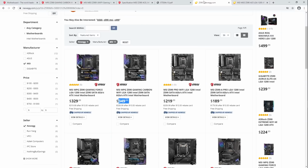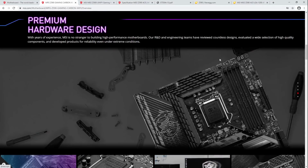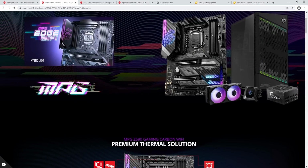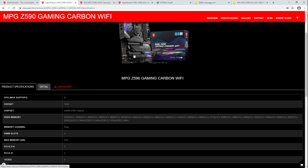I think there might be some boards that are more cost effective off the top of my head, but this might be one of the cheapest motherboards with a postcode. There are other motherboards where I've been like, oh my god, a cheap board with a postcode, and then I got it, and it's also got a 4-layer PCB, so while it'll tell you that your memory overclock doesn't work, it won't help you fix it, because the board just doesn't clock that high. But this is a 6-layer PCB. So it's not going to clock as high as the Ace, but 6-layer PCBs are still really strong.